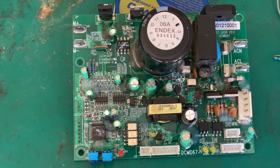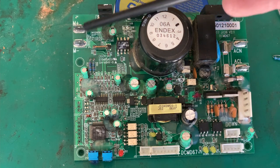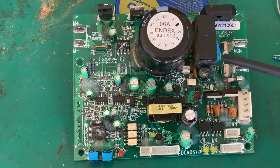Here we are on the bench with our board that our viewer sent us. You can see our AC mains comes in here, the fuse is missing, a whole lot of plug-in connectors that will go to different boards and different places, and these two connectors up here, M-plus and M-minus, are the motor terminals. This is a rather very simple board, and there's a little blue MOV there that looks cracked — we'll check that as we go along.